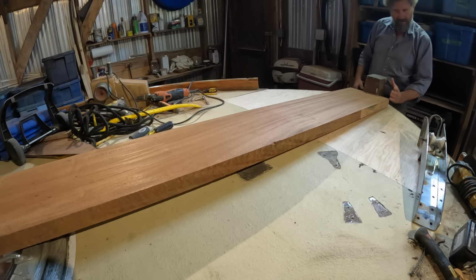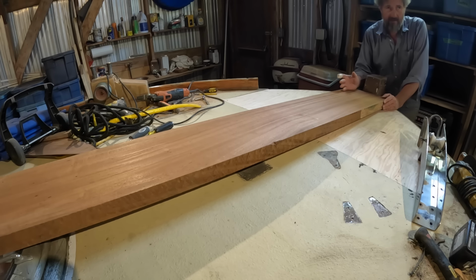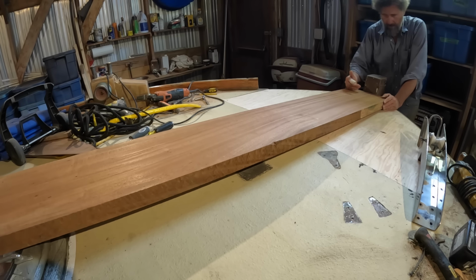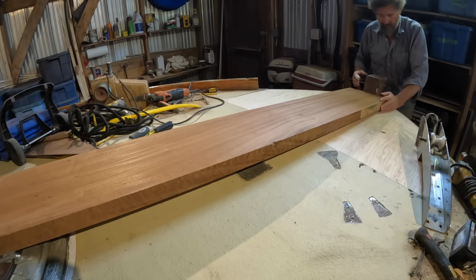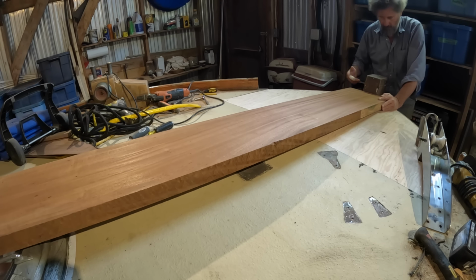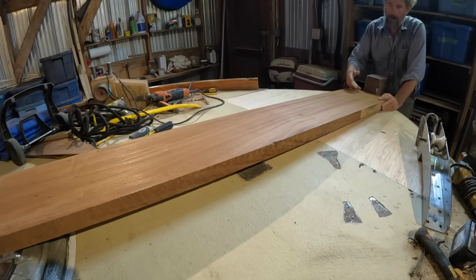Now you might say, well, the anchor's only on one side. Why do you bother with one on the other side? Well, the other side of the windlass does have a drum on it for rope. So there may be a situation where I just want to put a roller on this side, not a big bow roller assembly, but some kind of roller for line in case I'm having to haul something, or if I'm pulling something, I'm using the windlass as a rope drum.